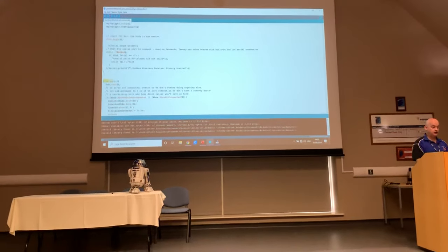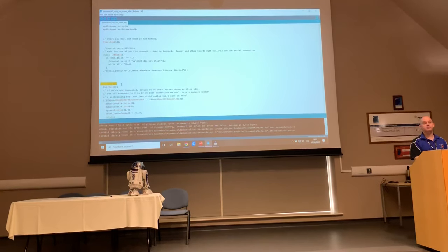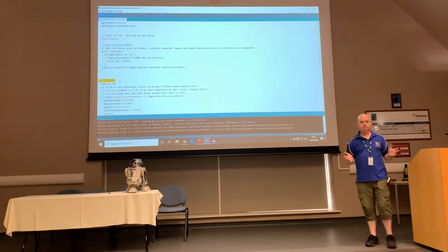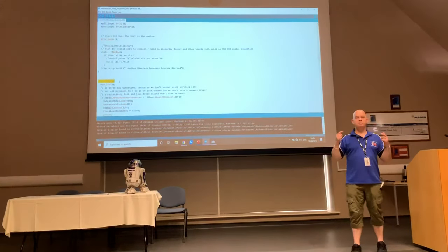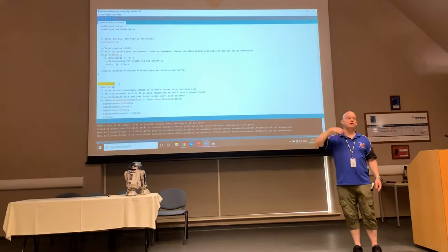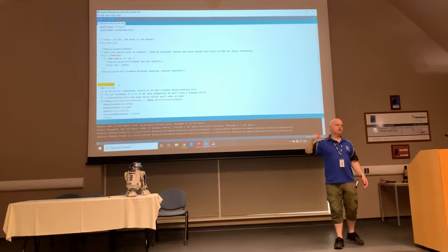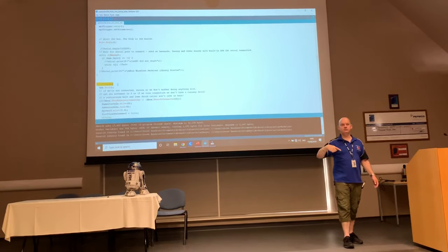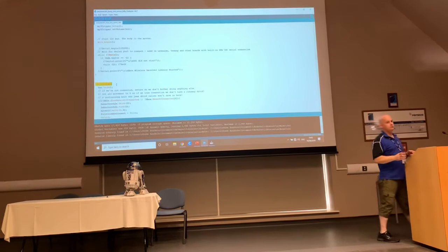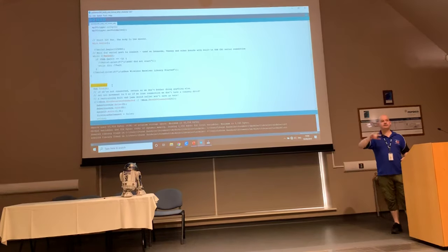So now we're into the meat of how this code works and what's known as the void loop. What a void loop is, again, I'm probably preaching to the converted here already, but the loop basically runs through start to finish, and when it gets to the bottom, goes back to the top, and repeats and repeats and repeats. Something ridiculous like 16,000 times a second, okay? So this is where we need to be slightly careful, in that anything we alter here could have a profound impact on anything else that's in that loop.